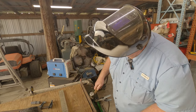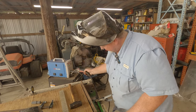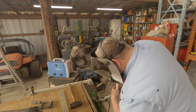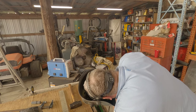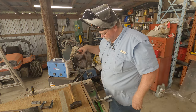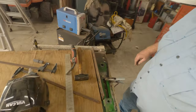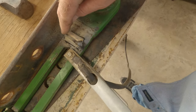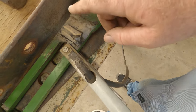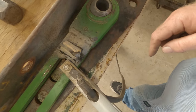Actually, that's pretty clean. I'm just going to throw another weld on it because I can and because I want to. That's pass number two, and that looks good. All I did was put it right beside the other weld. I'm going to knock this slag off and then build one right in the middle, then grind it. That looks like it will work just fine.